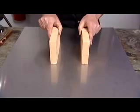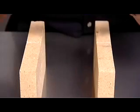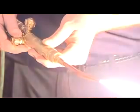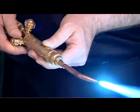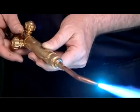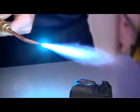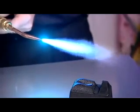Support the tube and fitting assembly to provide a consistent gap around the entire circumference of the joint. We are using an oxygen acetylene torch; however, air acetylene with a proper torch tip, or any fuel gas that can rapidly heat copper, would also be suitable. A reducing flame is recommended.